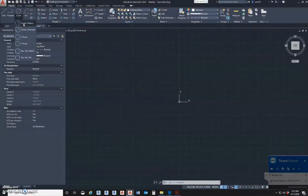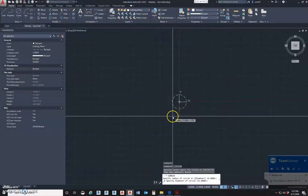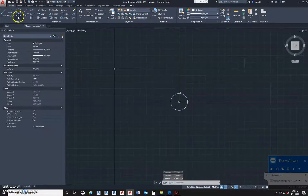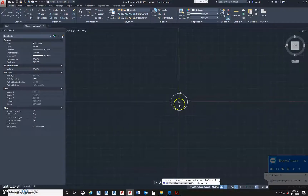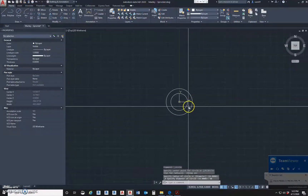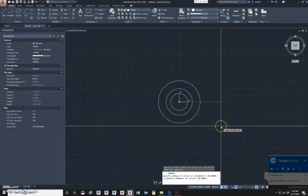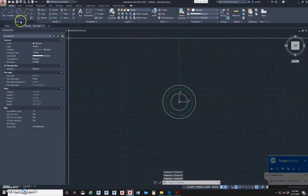So we have this circle with a diameter of 32. I want to start at 0,0. Do you notice I have the wrong layer? I'm going to change this to visible. Then we'll go back to circles again. This was a bolt center of 50, so we're going back to that diameter — that is a diameter of 50. And then the outer circle we saw was 63. That's a diameter because it gave the size of the whole circle from edge to edge. I'm going to put this one as a center line.